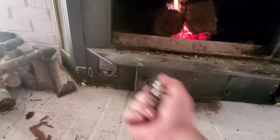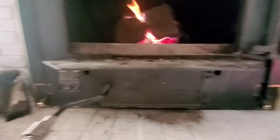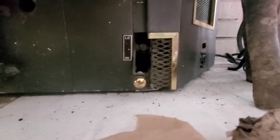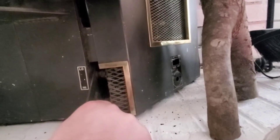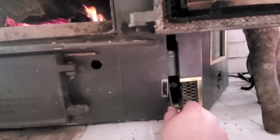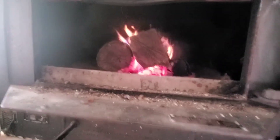You need to be making sure that you're keeping your ashes swept out and cleaned. If you pull off these blower sides right here — you can see that one's loose where I've already had it off — and you look up in here, you'll see there's a little bit of dust and stuff. That dust goes all the way down and under, and this right here pushes a flap up and down. That'll get filled with dust and dirt that will keep air from flowing into this, which allows updraft to feed your fire.